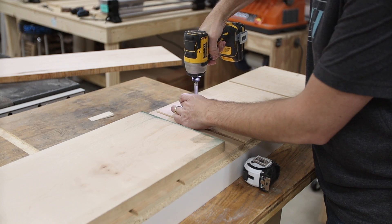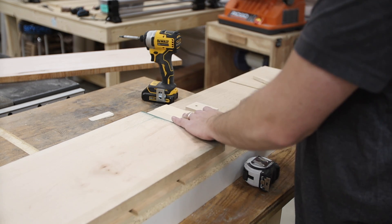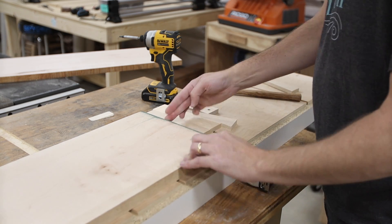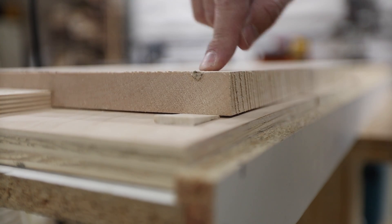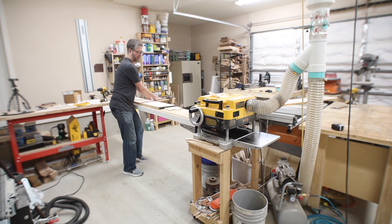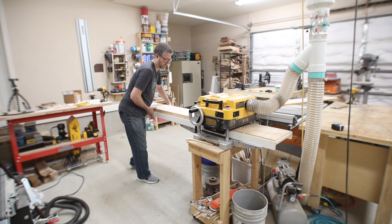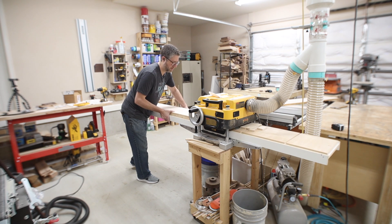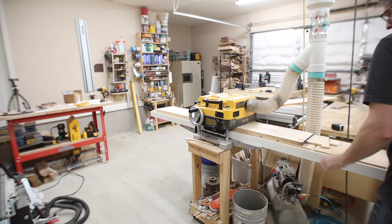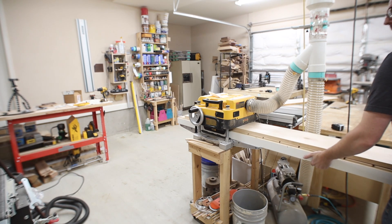It's finally time to test out the new I-beam sled. I grabbed a board and pushed it up against the stop block at the back, then added another stop block toward the front. To show you don't need the stop block exactly where you need it, I used a couple of spacers and cut some thin wedges out of half inch material and wedged the board in place so it could not move front to back. This board had a slight twist in it, so I cut some really thin shims and put them under the corner that had some flex. Do note that since I used melamine, this jig is quite heavy — it could easily be remedied by using a roller stand on the infeed or outfeed, which is still much cheaper than upgrading your jointer.